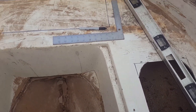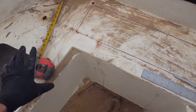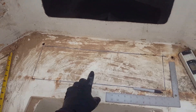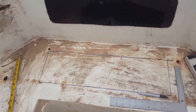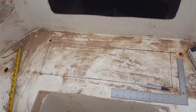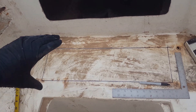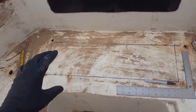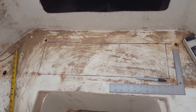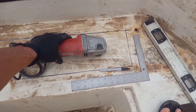You can see they've allowed three inches on this side, same thing over here — three inches. That's kind of where I got my methodology: I measured three inches from here to create something cohesive across both sides, and I also allowed three inches from there. The minimum you want to allow is obviously enough to get your hand in — think about items you may be putting in there — and also we're going to be using a grinder in that area.